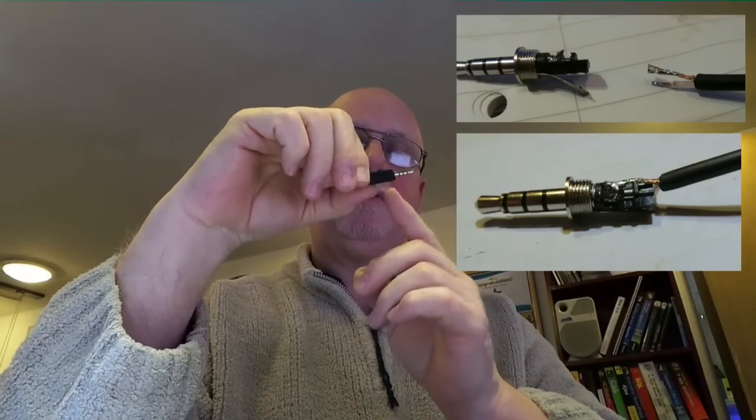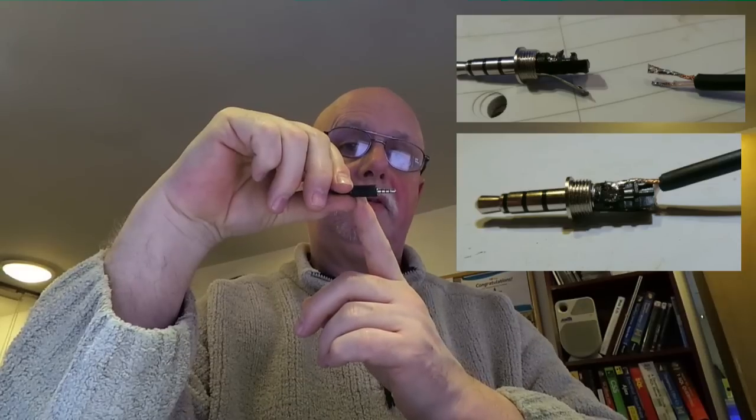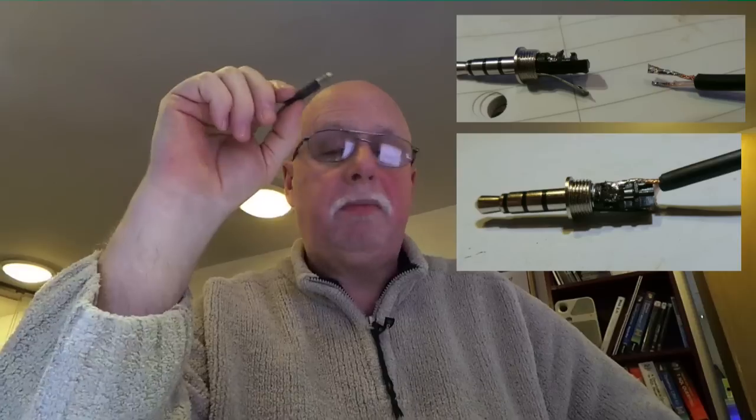You can put the microphone with a 1K series resistor. What you'll probably find, though, is that that series resistor will allow the microphone to work but it will drop its level down and drop the quality a little bit. It all depends on the mic.